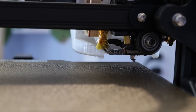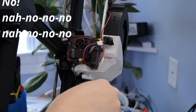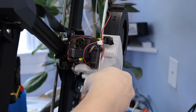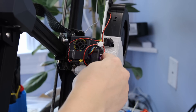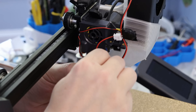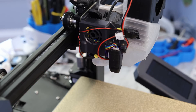First step is the purge line. Oh god, no, no, no, no — I need to bring this CR touch probe down a little bit. With the new heat break that I installed, everything hangs down a little bit further. Creality only allows you to adjust negative 5 millimeters, so any further adjustment and I'm going to have to physically move the CR touch, then add a stack of four washers on top of it. It'd be nice if Creality had an adjustable height CR touch mount, but we don't have that — it's just one of those Ender 3 things.